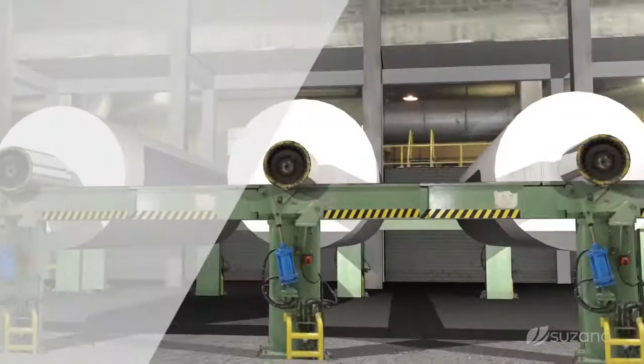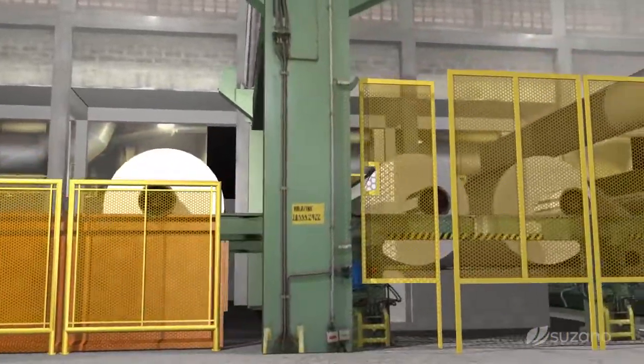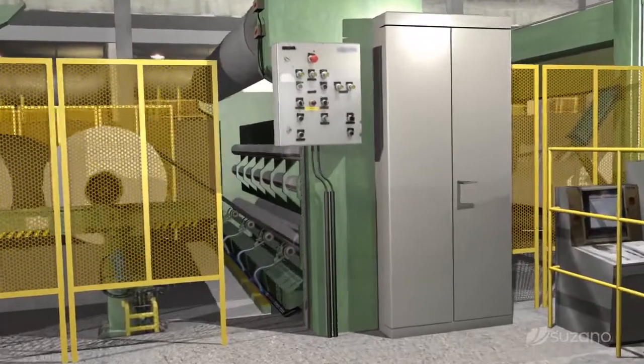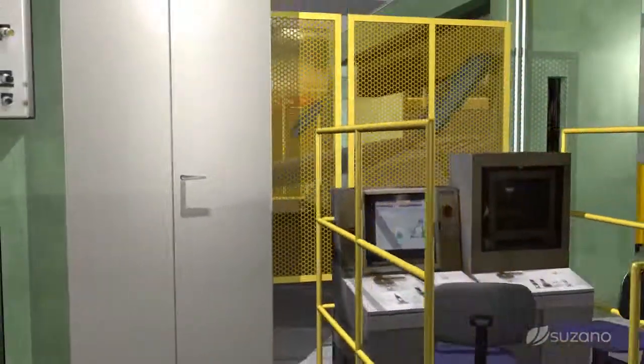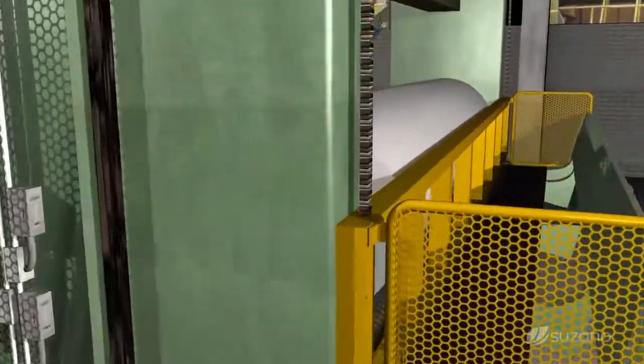Now completely ready with a shiny or matte finish, the paper will have two finishes according to demands: rolls or sheets. For the production of rolls, the parent roll is unwound and cut by circular knives, then forming smaller rolls that are wound around cardboard tubes.